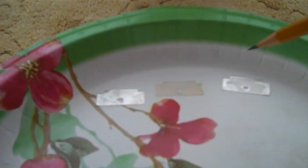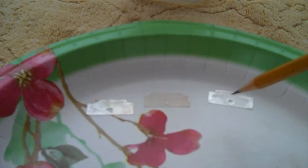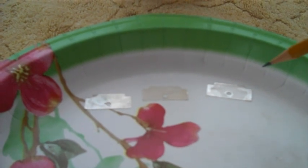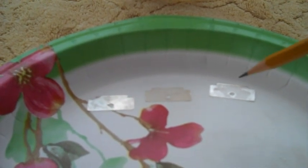Someone told me one time that you can take plastic from one of those blister packs, they call it, that have pills sealed into plastic. Find a flat spot, cut it out the shape of the original mica, and put that between the plates on the tuner, or even on a trimmer cap. The guy claimed that works well for him. I don't know, you know.